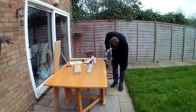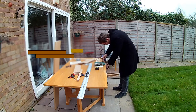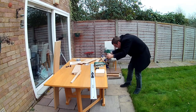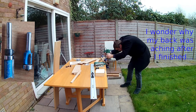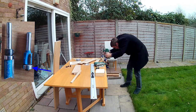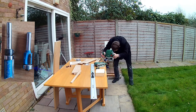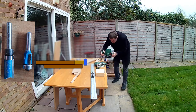Once I cut the strips to approximately the right size, I made a guide out of two more pieces of the 10mm oak. This allowed me to press the straight edge of the narrow strips for the shelf fronts up against the upper part of the guide and know that the front edge of the lower guide would be in exactly the right place for the width I wanted. This allowed me to use my new toy — my router with a flush trim bit. Flush trim bits are amazing: they have a cutting edge along most of the bit but also a small bearing at either the top or bottom. This bearing runs along the edge of a template or guide while the cutting edge cuts the workpiece to exactly the same size and shape. So in this case I carefully extended the router bit so that the bearing would run along the lower guide piece, meaning the cutting edge would trim the workpiece to exactly the right size.